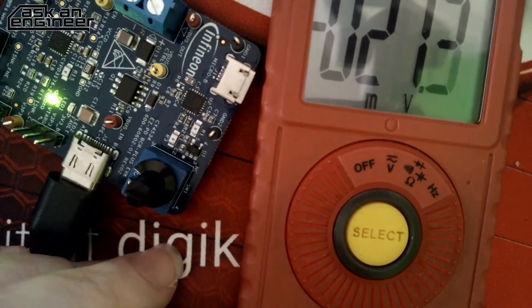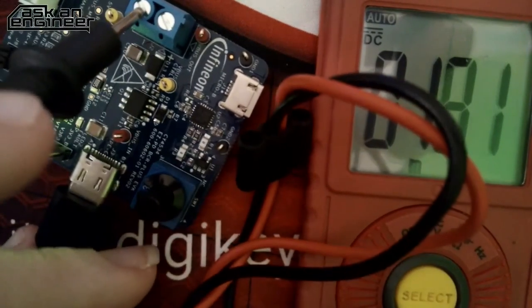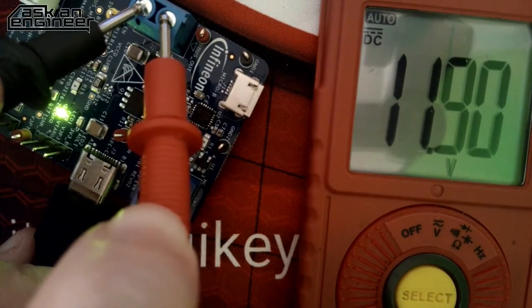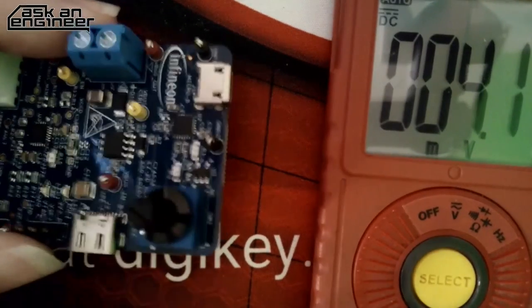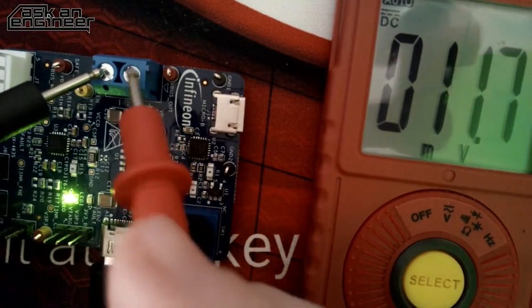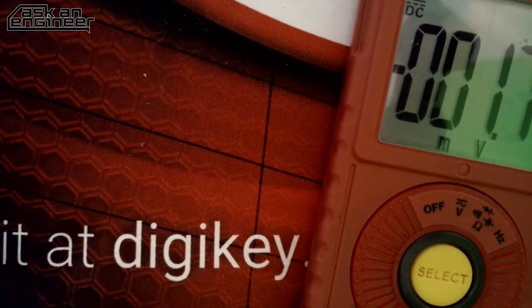and I want to measure the voltage on the terminal blocks. Let's get the right, this is negative, and this is positive. You'll see I get 12 volts out, and then I can unplug. And I just flipped this switch over to number 4. And then I plug it in again. And this time I measure it and it's 15. I have it plugged into my laptop power adapter, which can handle up to 20 volts.